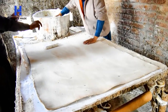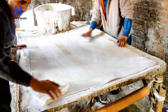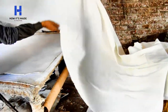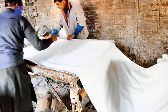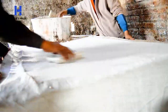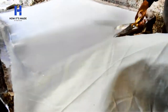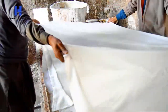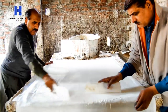This chemical is called latex, which is normally found in rubber trees, and it is being applied on a rexine sheet. Another coat of latex chemical is applied, and another piece of cloth is placed to make this sheet ready for football panels. When this layering process is done, it's kept in sunlight for three to four hours to dry.